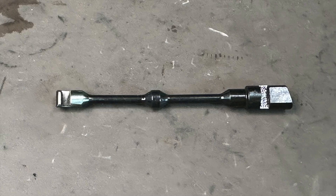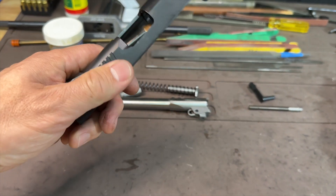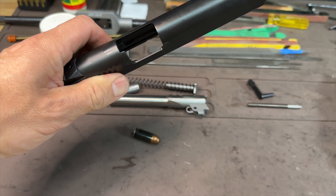Getting back into the up position was particularly difficult because your thumb is not as strong going in that direction. Since you have to manipulate that every time you touch the gun, that was a drag. The extractor had a very unique design, but it had no tension — a dummy round fell right through and was not able to be captured. So that was a bummer.